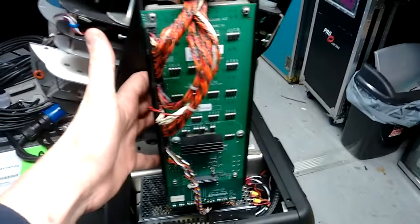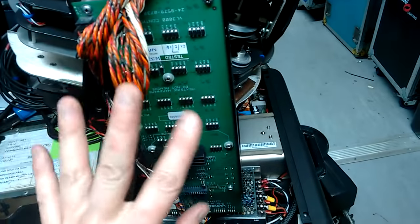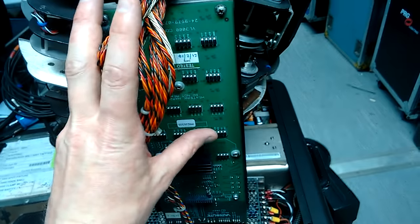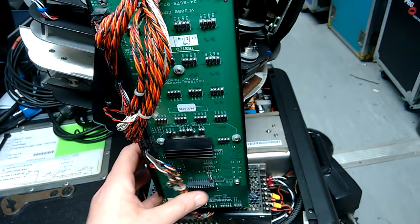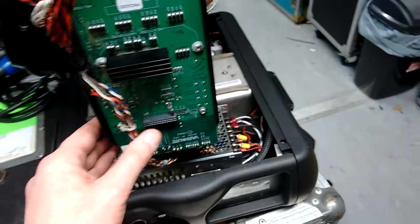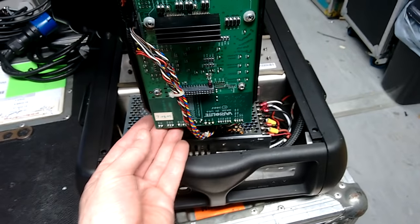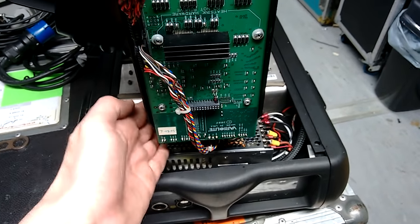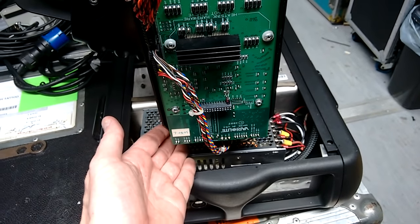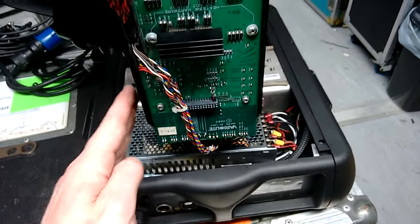The processor is mounted in one of the yoke arms, and as you can see from these diodes here, it's got all the stepper motor drivers as well, and the main processing section down here, along with some switch mode power supplies for deriving the 5 volts from the 24 volts. It also marshals power out to local fans and to the lamp control circuit, which is relay based.